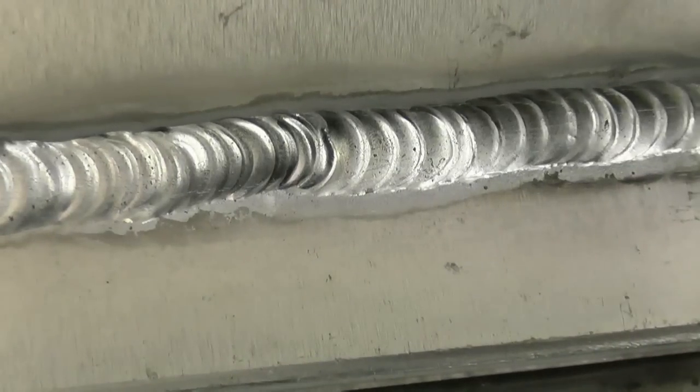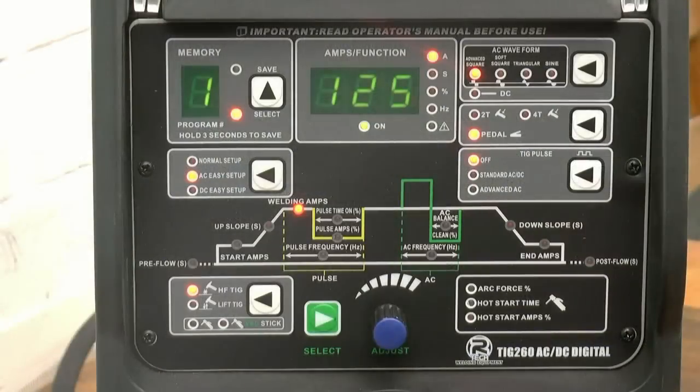The aluminium oxide coating melts at a much higher temperature than the base metal. That's why you need the AC to break through it. I think you'll agree that's not a bad weld. That's the sort of result you can expect on aluminium on the factory default AC Easy setup. We'll go through fine tuning the welder in the next video, showing you how I would set it up to do that particular job and the difference it makes when you set the welder up for each particular job.